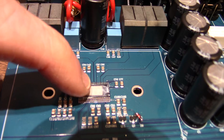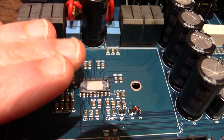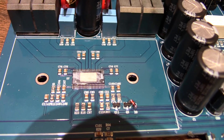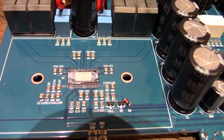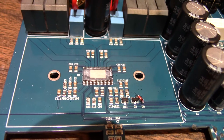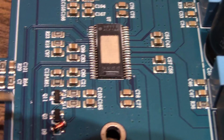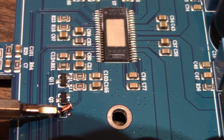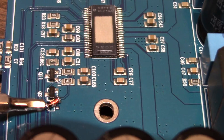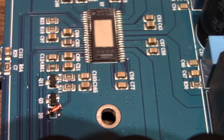The thermal pad — that metal area — is facing the heat sink this time. On the other amp it was facing down with the heat sink on top, so all the heat had to transfer through the epoxy, which according to the data sheet had a much higher thermal resistance — around 10 degrees Celsius per watt, whereas the thermal pad is closer to one. Much better. Big thumbs up for doing it right this time. That's a TPA3255 chip. I did notice this diode is crooked, but I think they did it that way because the component outline is too small for it to fit, so they just put it over and soldered it to lead to this transistor. It's connected — no issues there.